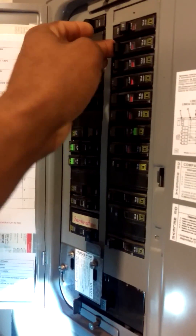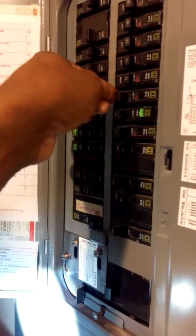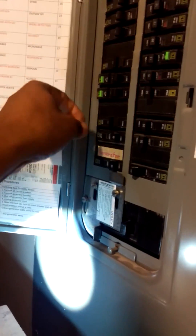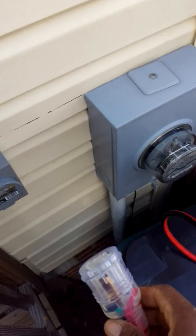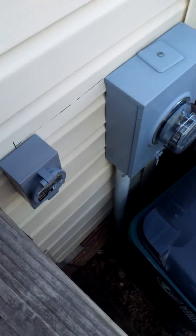And let's say power came back — to switch back to the main, all you do is come in here and turn off all the breakers. Turn everything off. Lights are going to go out. Turn that off, so everything is off. And you turn off your generator breaker. Generator breaker's off. Disconnect your twist-lock. And now you can slide the interlock back up, which will allow the main to turn on.